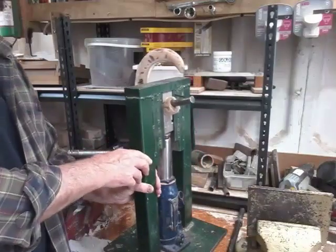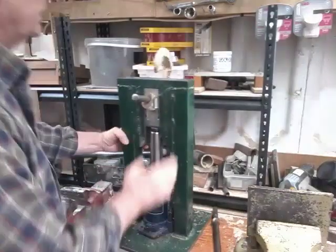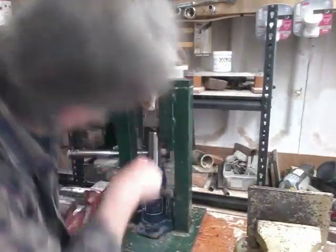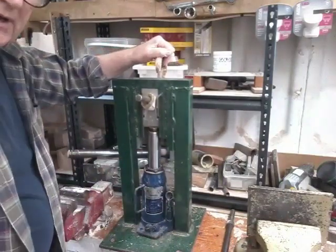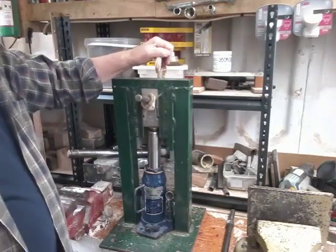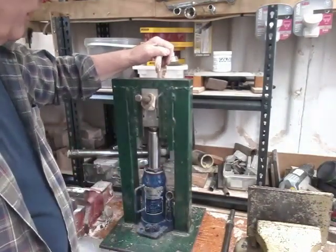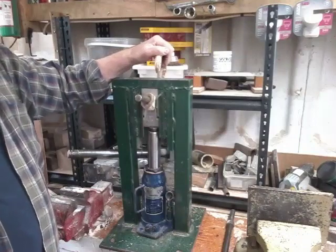You can see that we've fed that horn through a bit — we've heated the back end up, brought that forward, and we're going to squeeze up a bit more now. I'm not going to do too much squeezing to start with because I can always put this through again with different sized shells. The first thing really is to try and get a round section here, for what we call the neck. So we'll carry on and be right back.